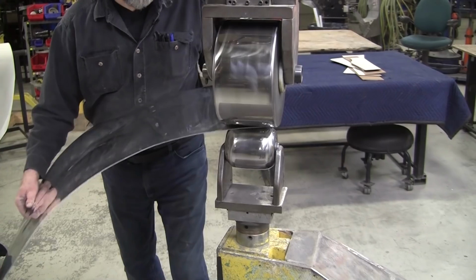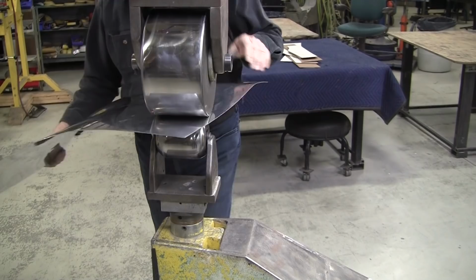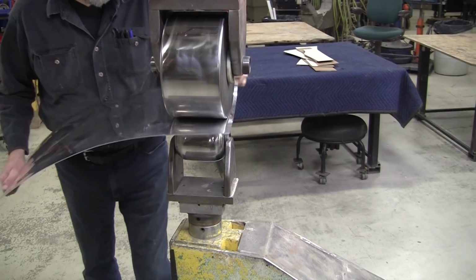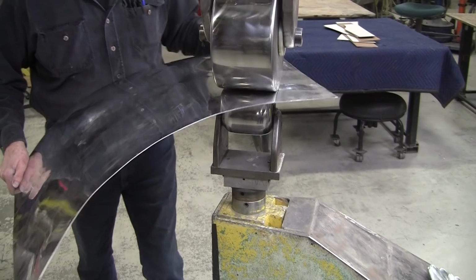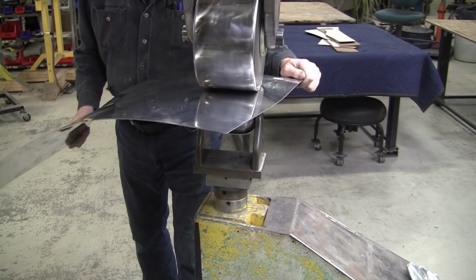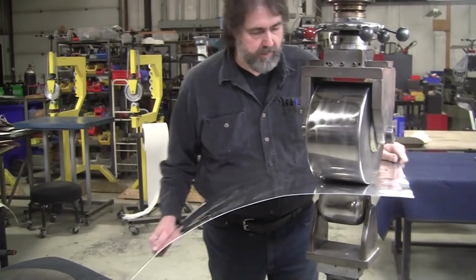And if we overdevelop in clay, we just fatten it up with a little more clay. If we underdevelop, we thin it out a little bit with our fingers. So we have the ability to add and subtract. We have the ability here on sheet metal to both add and subtract at will. If we want more area, we can stretch it and add more area at will. If we want to take area away, we shrink it. Doesn't matter where, on the edge, in the center of the panel, you can shrink anywhere. Once you get your techniques all down, it's all doable.